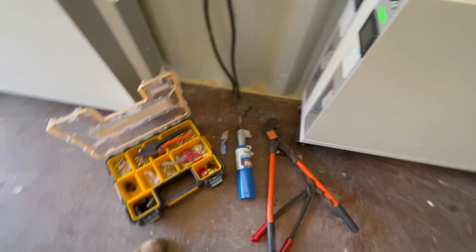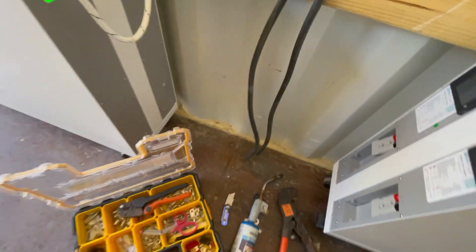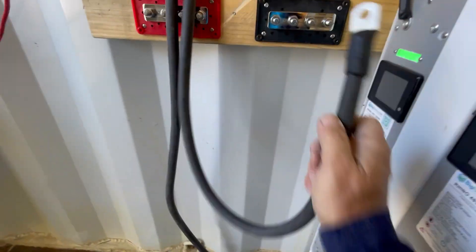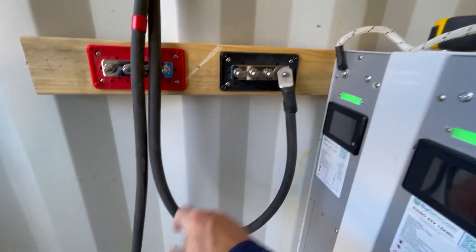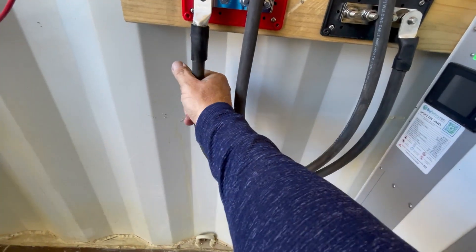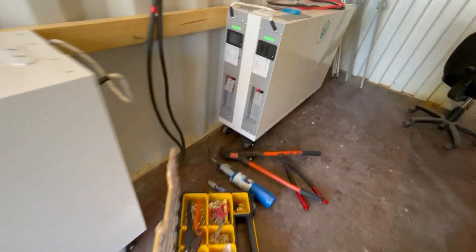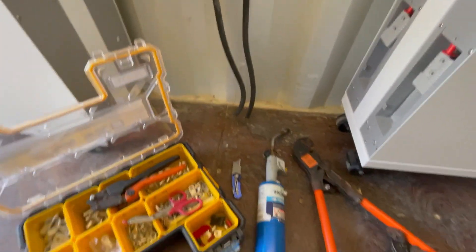Okay, it's getting serious. I got the lug box out and cut these 4/0 copper cables to length — they'll curl around to the bus bar. Over here where I already finished: the negative cable curls around and goes to the bus bar, the Anderson cables come around and go to the bus bars, and the positive cable likewise goes to the bus bar. The covers go on, and the Anderson cables come out and connect up to the bus bar — all in parallel.